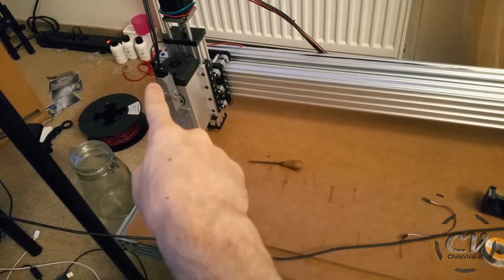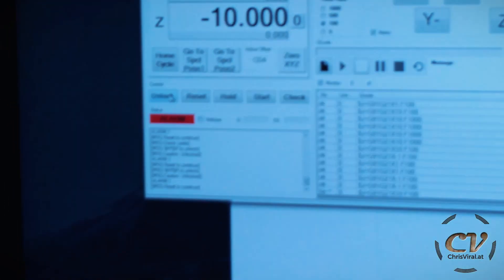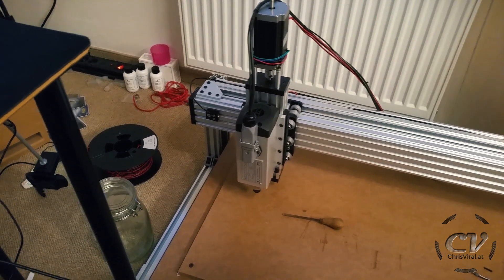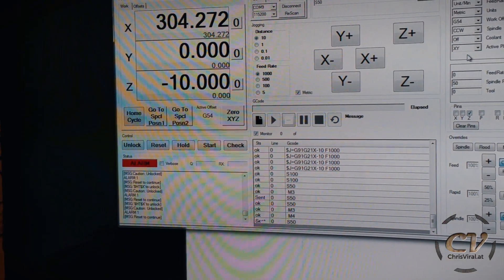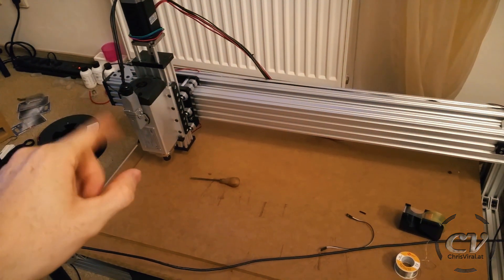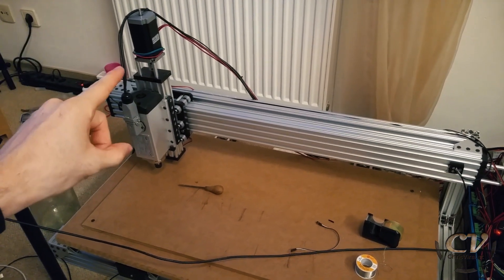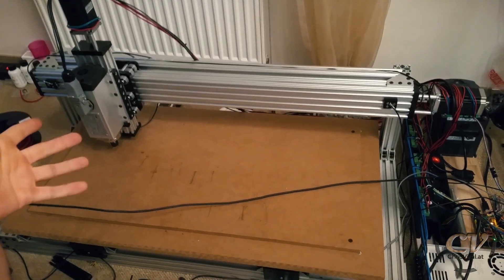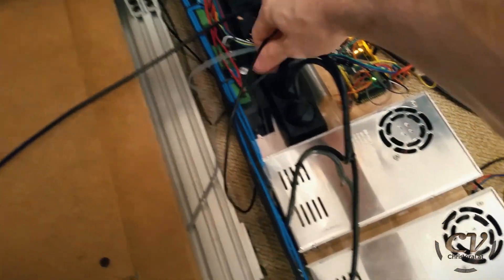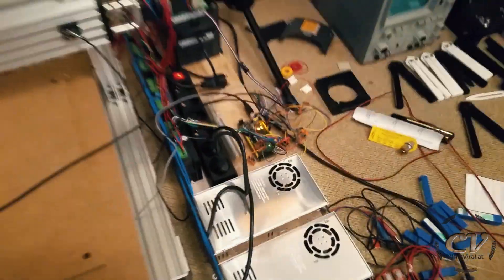It's working — that is my first hard limit! For the last test, let's activate the VFD — if this doesn't trigger anything then I'm safe. It just got activated — but that's no problem. When it gets to the spindle though, it does get triggered. But I think I might still be fine because without the spindle I could still do the homing process and then work with soft limits. So let me exchange all the limit switch cables. Finally done with all the exchanges — it was still triggering randomly, and then I noticed the cables were directly above the power supplies. So I moved them, and that should work.